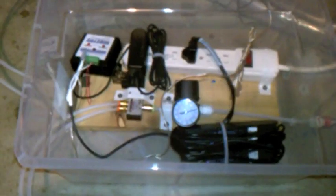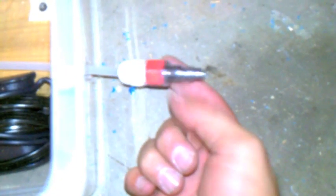This is a pneumatic prop, okay? So you have to have air to run your prop, correct? So air in: the compressor is that way, so I will just plug that in so air can go in. You put it through a regulator so you can regulate the amount of air pressure going into the prop. You spin this knob and turn the pressure. It's got a plus or minus, really easy.